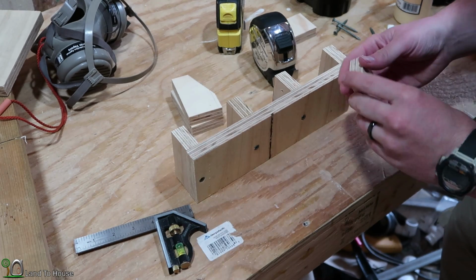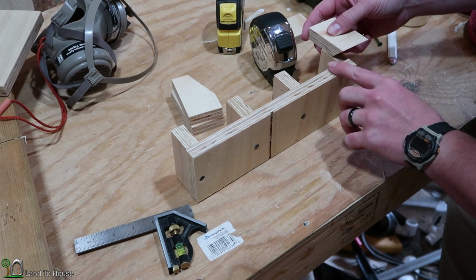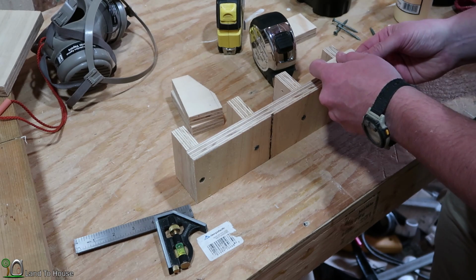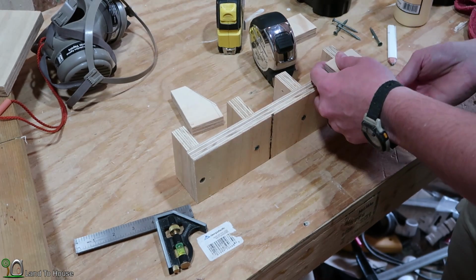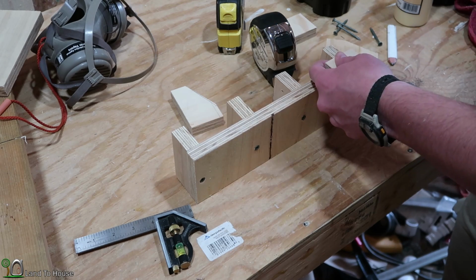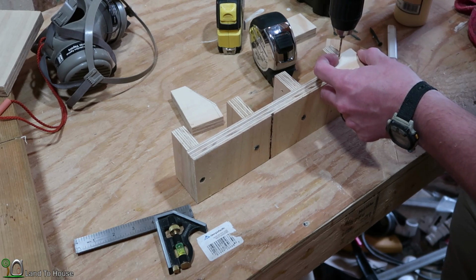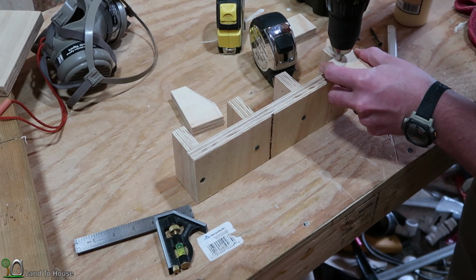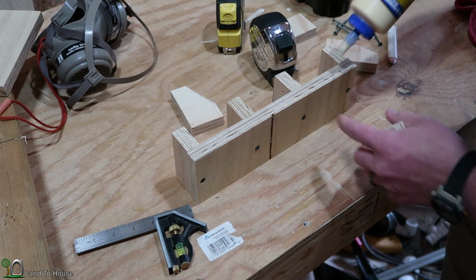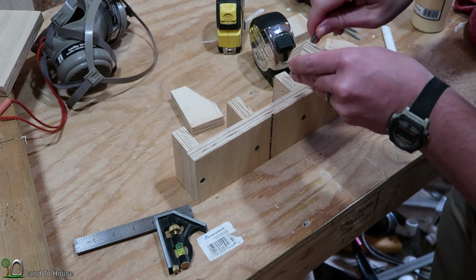Now I was just looking at this. If you had a piece of cleat like this, you could probably just put it up here even and use the shelf down here as part of the security, but I'm just going to do the usual and put it down here. And so this foot piece can go in the front here as the locking mechanism. Should be okay. So let's go ahead and get this lined up on the edge. And I've found that just using a single screw usually works pretty good. So do that. Plop of wood glue. And then one of these 2-inch screws here.